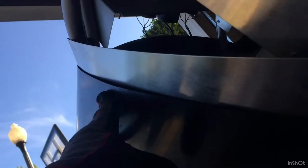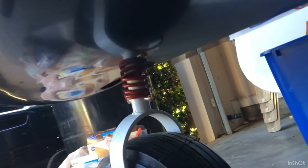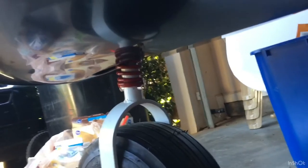I'm putting the side strip on here and doing five rivets underneath. When you're putting this on, you want to make sure it goes on nice and smooth to the side. I'm going to put in a screw every six inches, and then I've got to do some finagling underneath the nose wheel. A lot of times when people put these on they don't have the nose wheel in place, so it makes it a little more challenging, but we'll get it.